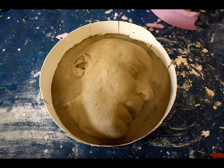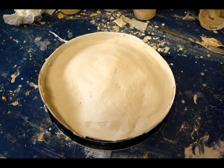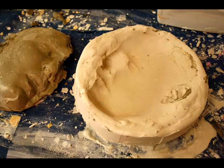This clay sculpt is exactly the same as my face and is suitable for making the plaster mould from, meaning we don't put plaster directly on our skin. Before making the plaster mould, I sealed it with some spray paint — I used Plasti-Dip, but you could use any rattle can. Just make sure the clay is not too wet so it sticks properly. The clay will eventually dry out and you want to make the mould before it does, otherwise it will shrink and crack. After sealing the clay sculpt, we made a plaster mould from it. We let the plaster set for an hour, then flipped it over — the clay came out quite easily because it had been sealed. That left us with a plaster mould to do the latex cast from.